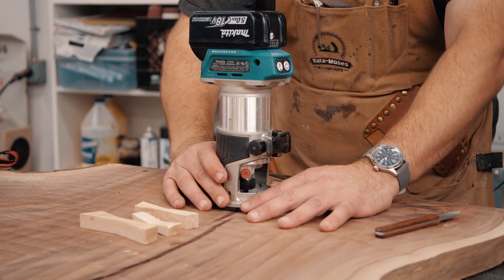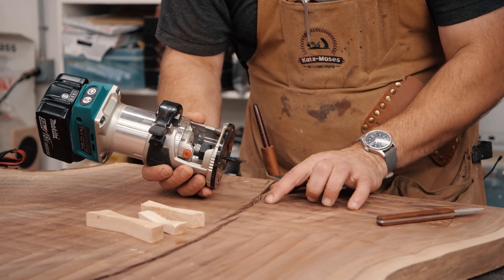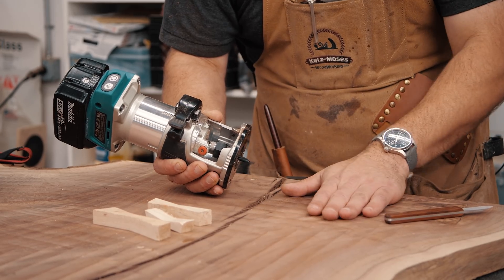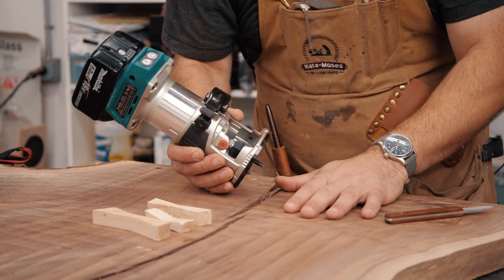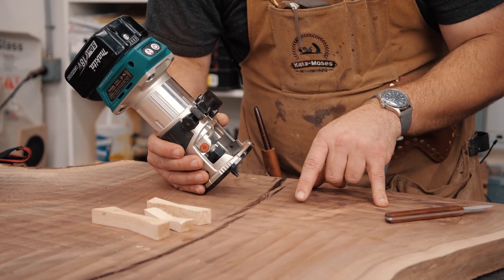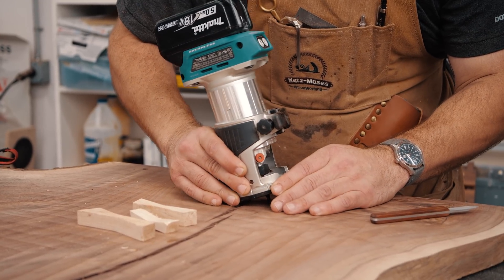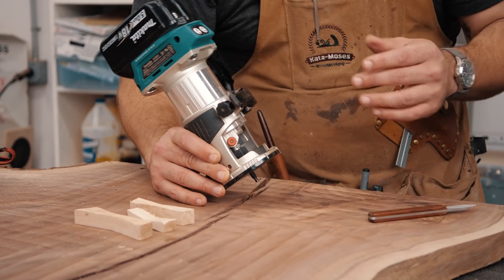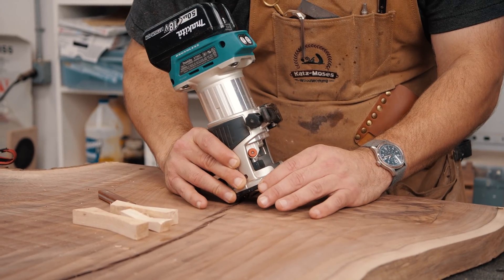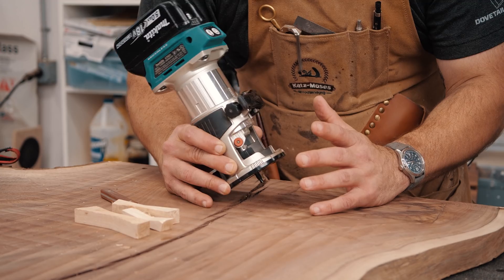Because we're taking a full depth cut, we really want to get as close to the line as possible, and having your hands be the brakes is what allows you to get really close. Take really, really small nibbles. I'm going to go ahead and plunge my router — it's going to be a little smoky because I chose a down cut bit. You probably could use an up cut bit here, but because I'm pretty good at getting close to the edge, I didn't want to risk having fluff come up that might cause tear out. This slab was kind of warped and is now only an inch and a half thick — I don't want to take any more off. I'm going for the best finish on my top edge.